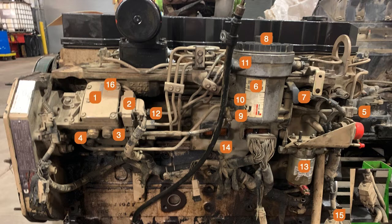Number 12 is the high pressure injection lines. One of the reasons I like this fuel system is the pressure range is about 2,500 to 3,200 PSI up at the injectors. So if you have a line with a problem or the engine is idling and missing bad because there's air in it — and these can be a bugger to get air out of — you can safely take those nuts loose on the fuel lines. When I put a pump on an engine, I'd always leave the easiest three to get to about a turn loose, and that would help get the air out of the pump. If you tighten all those lines and there's a lot of air in there, it can be difficult to get the engine started.